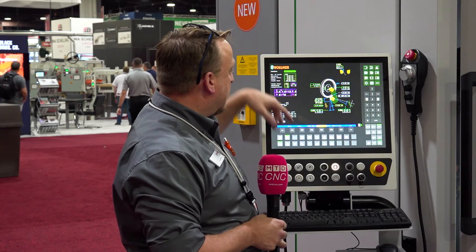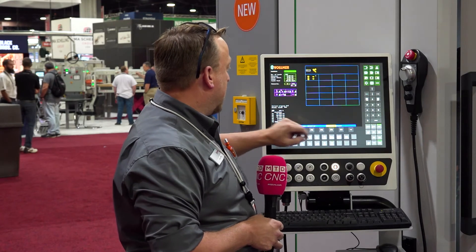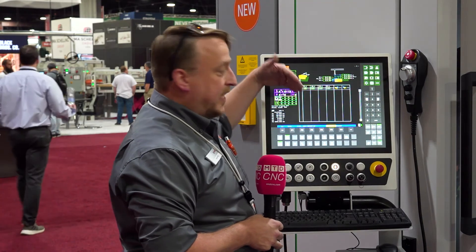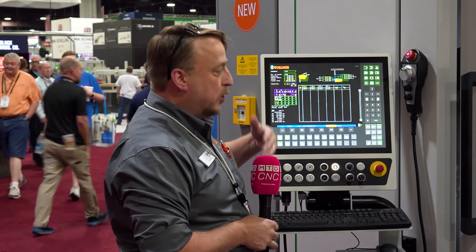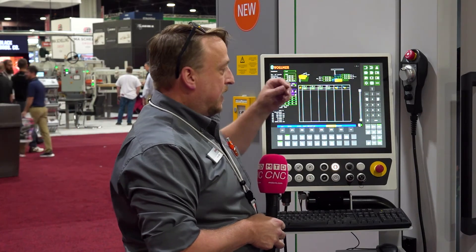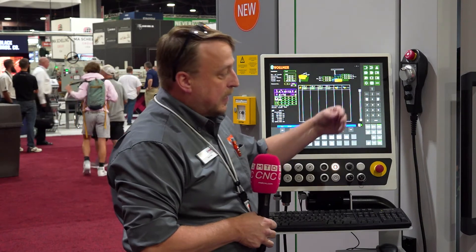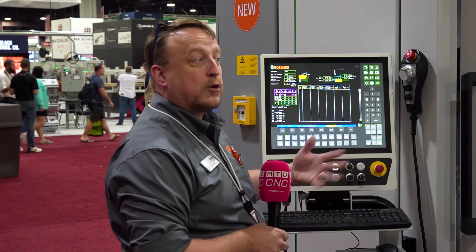Yes. So basically what they've offered now on here, you can actually do a measuring cycle for the Z, X, Y, V, and W axes, and it will print out your diameters, your back clearance angles, your hook angles, your kerf, your tangential angles, and radial angles. And what that'll do is prove at the end that everything is within your specs. So you can see if it's not, and then go back and check to see if maybe there's a measurement that's not right, or something was inputted into the program incorrectly.